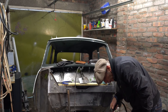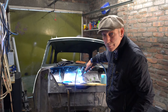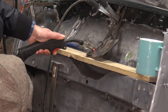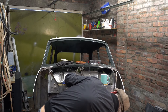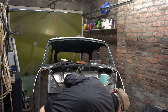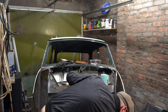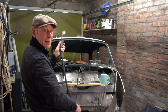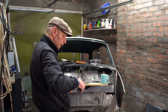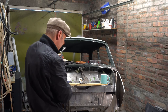I've got this setting on my welder at number 6 and I'll just check what kind of weld this gives. Right, that's too slow. Nearly... that's sounding better — do you hear that? I've got problems with my wire; it may need to go just a little bit higher. And there's my wire sticking again — apparently that's a common thing with these welders. You take the torch away and it spits the wire out; you put it back on the metal and it stops working.